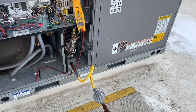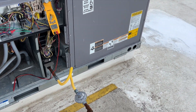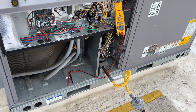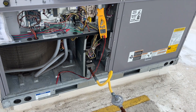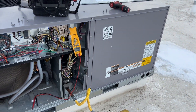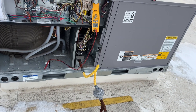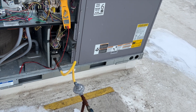She's been running now for about 20 minutes without any further issues. I think that motor overheated for some reason — amp draws seem to be fine, pulling 6.48 to 6.52 amps max. I'm going to go ahead and close it up and suggest we replace that motor. Filters are clean, coil is not blocked, there are no restrictions in the ducting — so maybe there's something wrong with that motor.